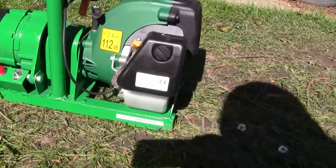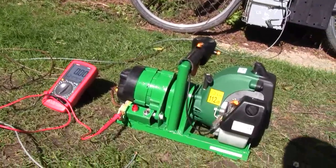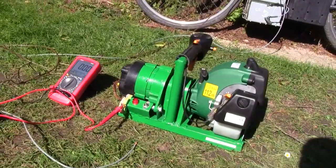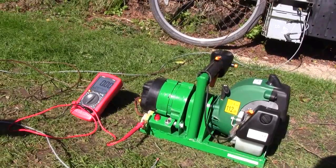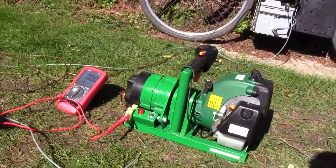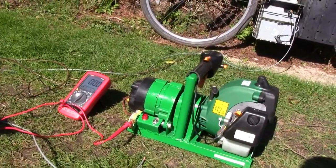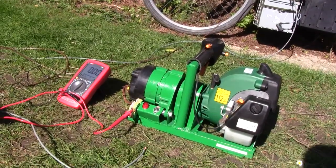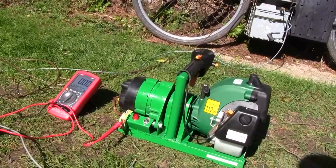The engine, according to the label on the side, puts out about 600 watts, which without losses is about 50 amps on 12 volts. So with losses, probably about 30 amps if it was running in its most efficient format. So I think what I probably need to do is have a 2 to 1 or 3 to 1 reduction between the engine and the alternator for it to give more current out.